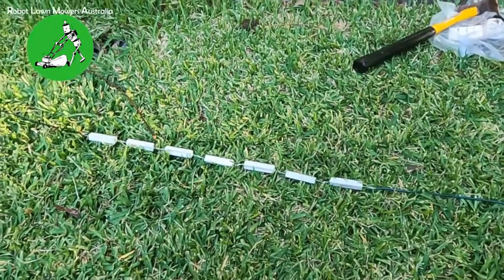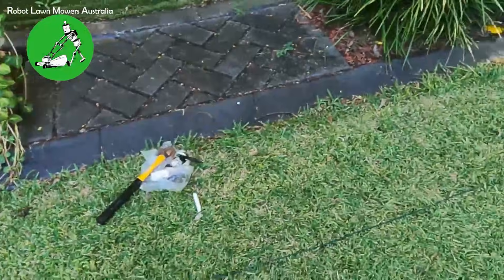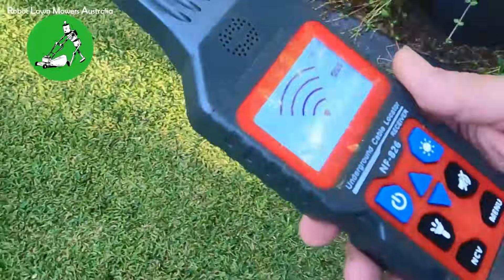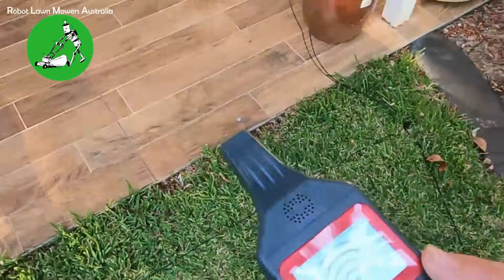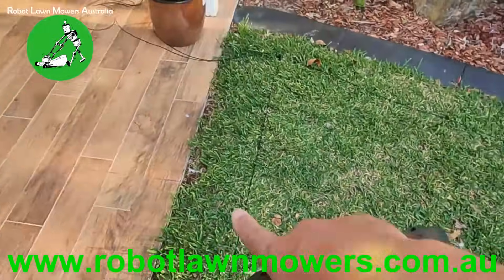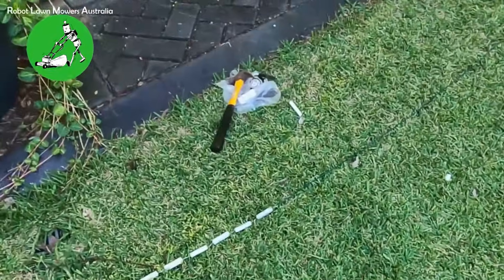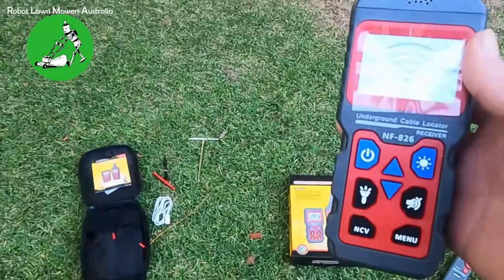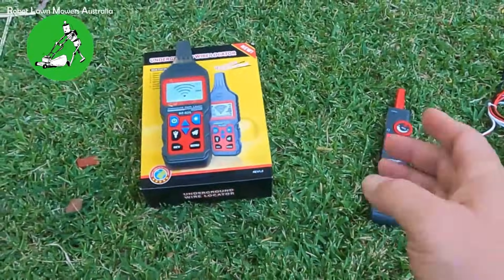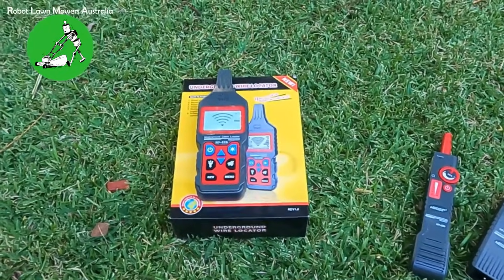If we're looking for a wire that's not completely broken, I'll set it as it is now, walk around the wire periodically, put the receiver down, and take the signal strength reading — say 300 at one point. Then every 10 or 20 meters along the wire take another reading. If it drops to 230, I know there's something wrong with the wire between those two readings and I work my way back to find the actual issue. That's really the biggest difference between the NF826 and NF820. You can do essentially the same thing with the NF820, it's just a bit more difficult to interpret the lights and power, whereas the NF826 gives you a little more information.